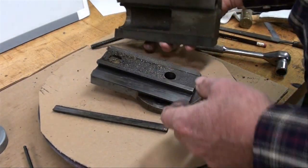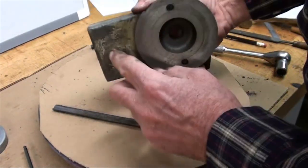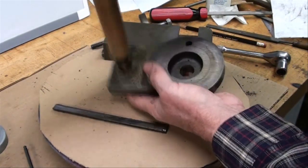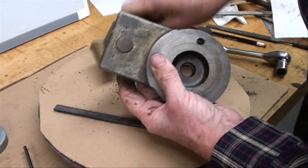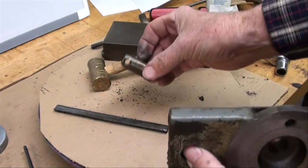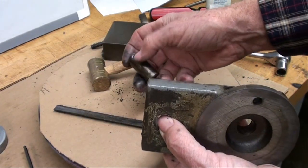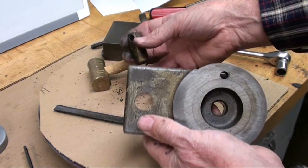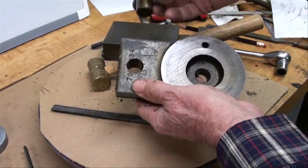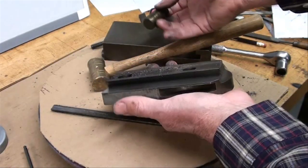On big automated machinery like at Caterpillar they have automatic oilers that keep those surfaces lubricated. Here's the brass nut — let's see which side it's going to come out better on. Brass is soft, so be careful how you treat it. There was a set screw there and I've got that backed off. There is the nut — acme thread, of course. I'm going to take the burr off where my thumb is on both sides; I'll put it on the lathe and just dress it up a little bit so it slides in and out cleanly. It's a very nice fit — you can tell this is well made.